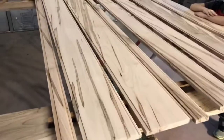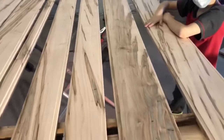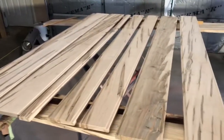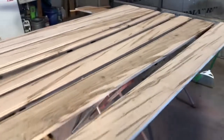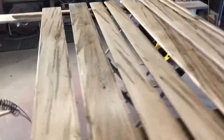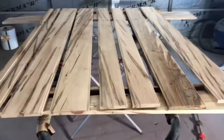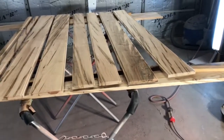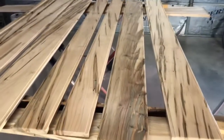If I get three coats on today then level sand the boards and flip them over and do a few coats tomorrow, part of that — touch it and we'll brush it off. So we're ready to put some finish on this. All right, here we go. There's one coat. Gonna give it about an hour or so to dry real good and I'll level sand it with 400 — at least scuff sand it. I can put three coats on, see where it's at, maybe put two more coats on tomorrow. I gotta do the other side as well.